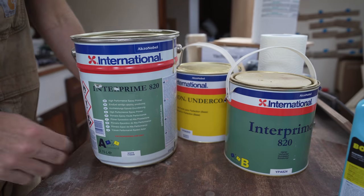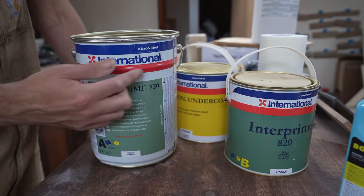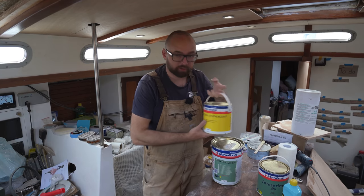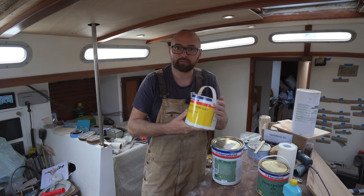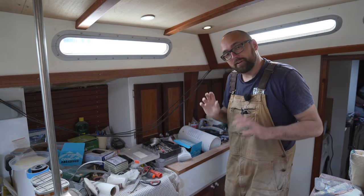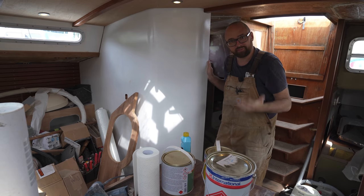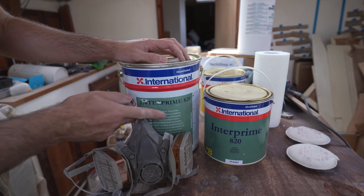To paint the shower and the head I'm going to use the same process I've used on all the other visible surfaces inside of the boat — all Interlux or International products. The primer is Interprime 820 and for the paint in the head and the shower I'm going to use some undercoat. The reason I'm using undercoat is because I've got a bunch of it left over from last summer when I painted the topsides — it's the primer used underneath Perfection Pro. I also used undercoat as a paint in the galley and that seemed to work out very well. It is a little bit more glossy than the interior finish, which is the paint I used on this bulkhead — a little more satin finish which I really like. But I've got a bunch of this stuff left over and I don't want it to go to waste.